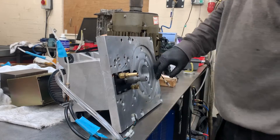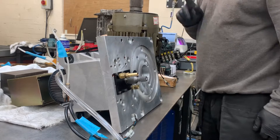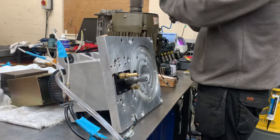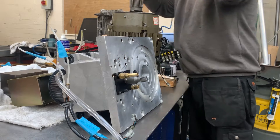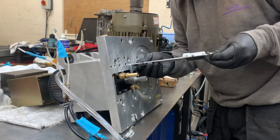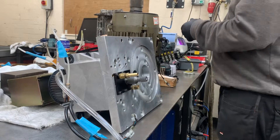It might be the fact that I've cleaned so much dirt away - this step machined into the plate to locate on the motor is actually not as deep as that shoulder. I think I might have been there. Let me measure that - let me get a caliper. We've got a 7mm shoulder on the motor and we've only got a 3mm step in there.